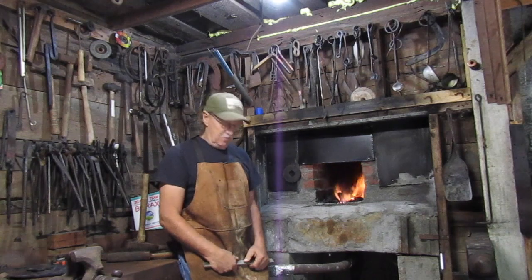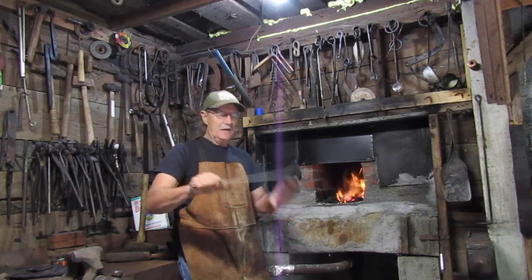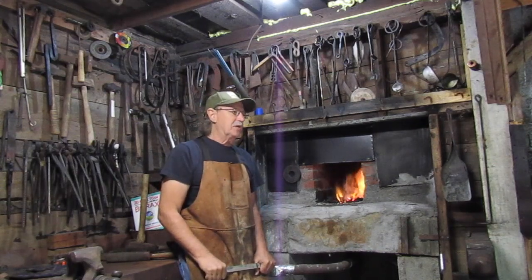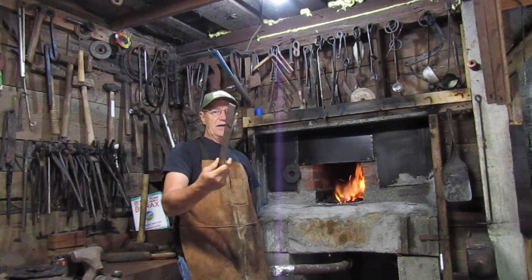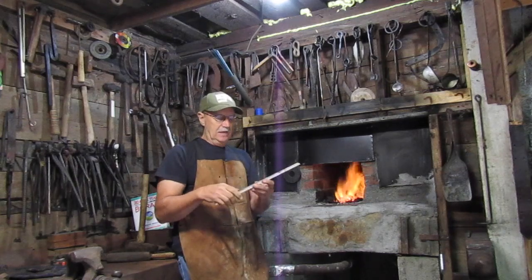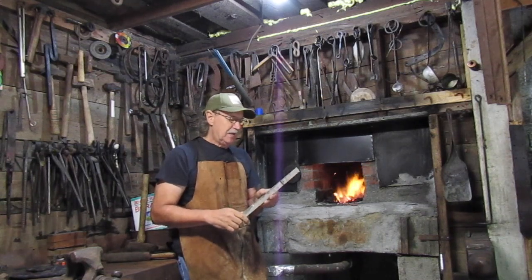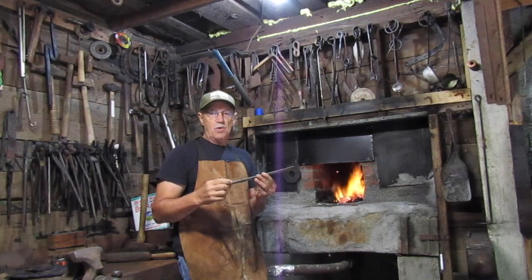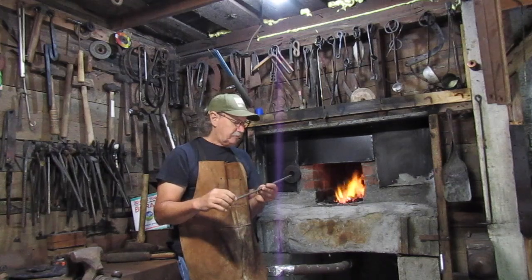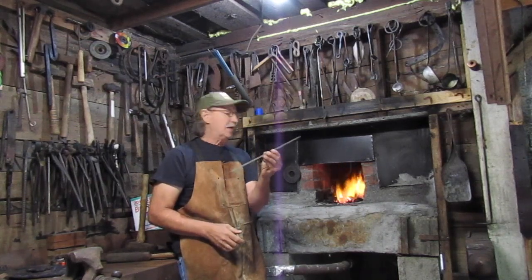At that time of the year, just a couple of months away when the trapping season comes in, in this video I'm going to show you how to make yourself a fleshing knife — a tool to take that flesh right off of them skins that you want to tan. This is pretty simple and easy to do. I've got some scrap stainless steel here that I'm going to use for this video. It's going to make a really good tough knife that will not rust even though we've left it laying around in some really bad conditions. It's quarter of an inch thick, it's an inch wide. We're going to draw the handles out so we can insert handles on it. So let's take this piece of stainless steel right here, the strap, to make a fleshing tool.